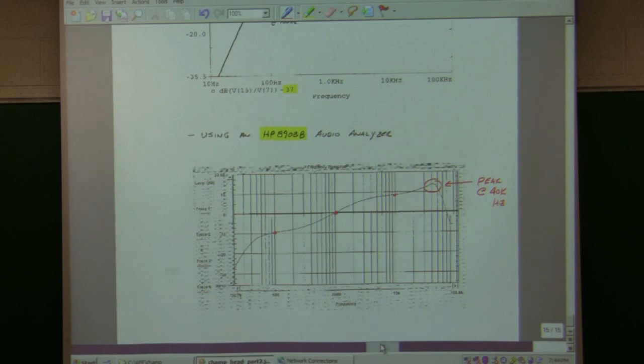It's giving gain to the noise that's present in the circuit, and you get some oscillation or ringing on the output. Now, you can't hear that. Well, this one, you might hear a hiss in the speaker, but when it goes farther out, you can't hear it, but it's dumping power into the speakers. The amplifier is giving up the power to heat up a little bit more. And so getting rid of that's important.